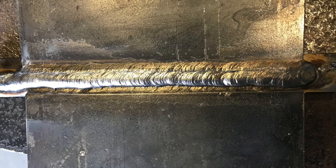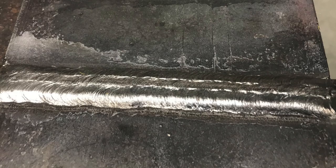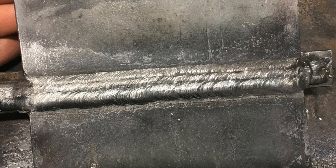If the groove between bead five and where bead six goes is a little tight, take a grinder and open it up to ensure good fusion down into the joint. Your final product should have a nice smooth cap across the top with a typical 50% overlap pattern. This weld will be on display in the classroom — come check it out and ask any questions you have.